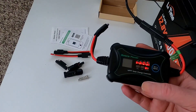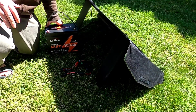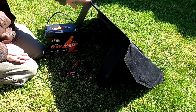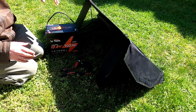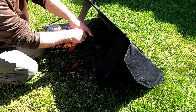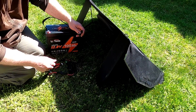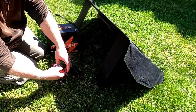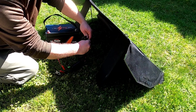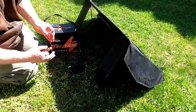I've brought everything out into the backyard now. I've got a 100-watt folding solar panel as the test example and my battery is outside too. Most solar panels use MC4 connectors, which is exactly what we just wired up. I'm simply going to plug the male into the female on both connections and hook this up to the battery.